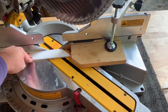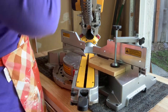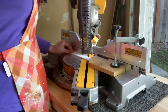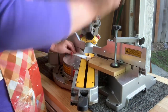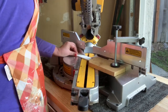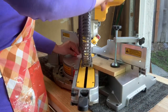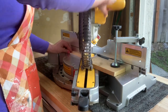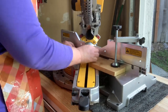I already have this set up so I'm going to go ahead and move to the big saw. It's time to start cutting the lath. I'm going to cut it in one direction first with the paint side up, and we have that jig there so they'll all be the exact same size. When I get about halfway through this piece of wood, you're going to see me turn it and cut from the other side upside down. The reason I'm doing that is I only painted one side of the wood and I need paint going in both directions.